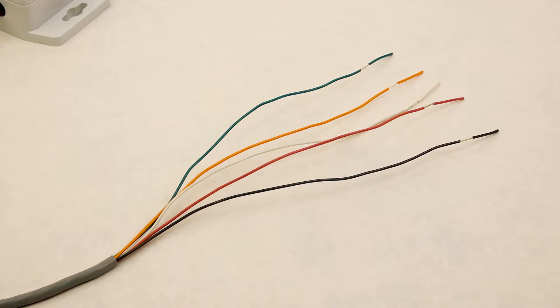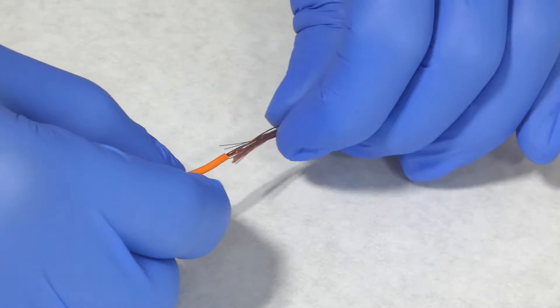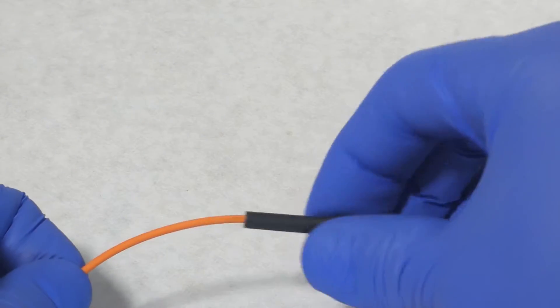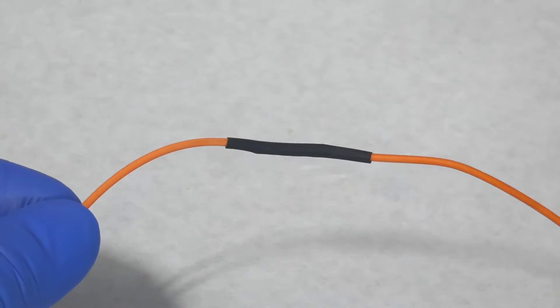The emulator has five wires that should be soldered for long-lasting, reliable operation. Strip the wires back enough to fray the ends and twist them together. Make sure to saturate the copper and not just tin the surface. Finish with some appropriately sized heat shrink.